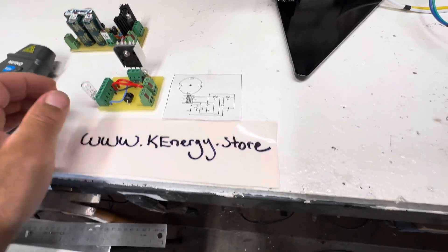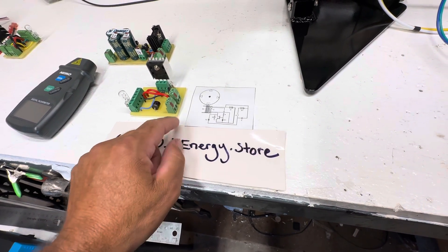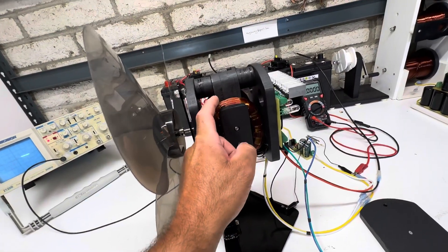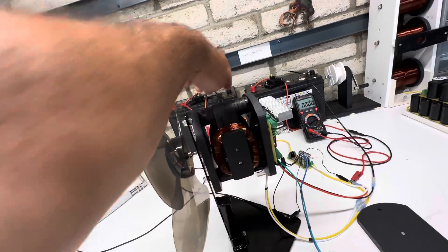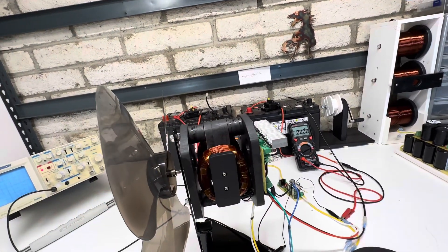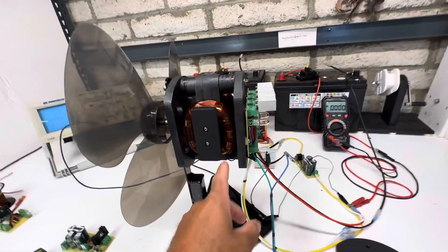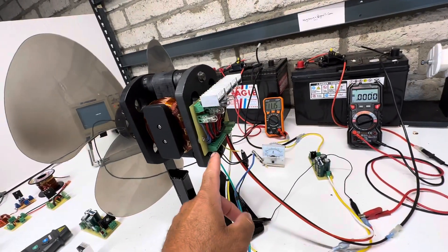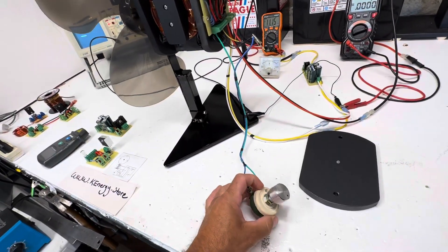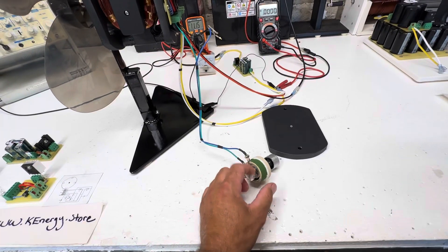For those of you who aren't familiar with it, it's exactly like this one. We have two windings — this one has two windings of 18 and one winding of 26 on both sides, so four windings total. Each transistor is controlling one winding, and then the smaller one comes through here as the trigger that goes through the light bulbs. This pot is actually going to be on here later — it's a 1K pot, but I'm getting a 300 ohm pot.